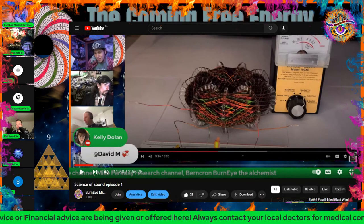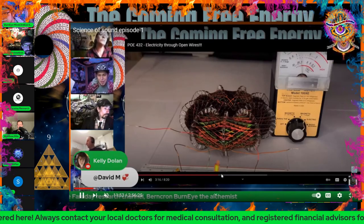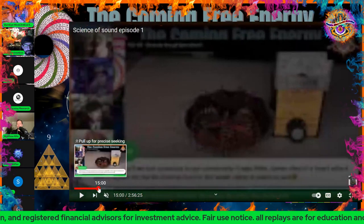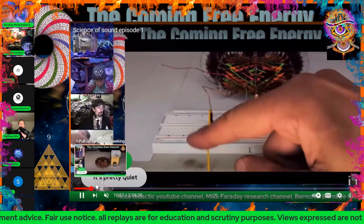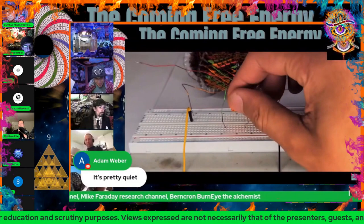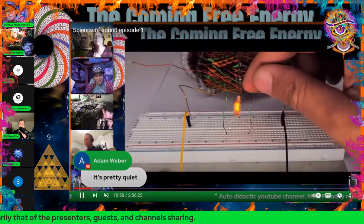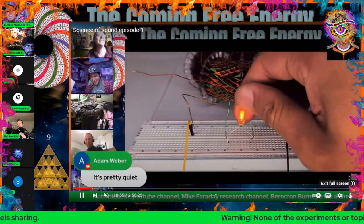I've taken a look at the POE geometry, and so has G. And the POE, from an electrical engineering perspective, which is where I'm coming from, has so much lossy interwinding capacitance that can't be recycled. It unfortunately ends up wasting almost all of its flux in creating ionization or high potentials that are lossy between the conductors, and it doesn't encode them geometrically in an ideal format. They're all shifted 90 degrees out. So where the idea is sound, the geometry and the style of winding is unfortunately not.